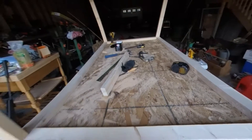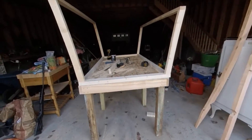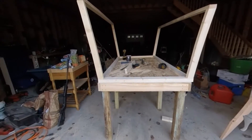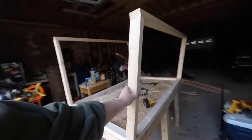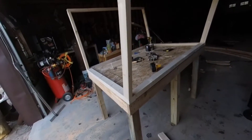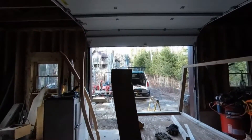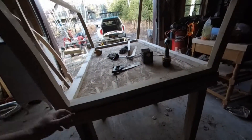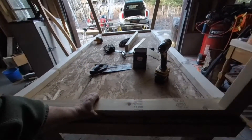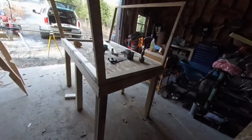The plate is in — it's not nailed down to the platform yet because we have to take the platform outside to where we're going to put it, and the roof height will not clear in here. So I'm going to have to build the framing in here off from the platform and then put it up on it before I do all the siding and get it heavy. Top plates are on — this is all two by six ripped in half so far for this framing.